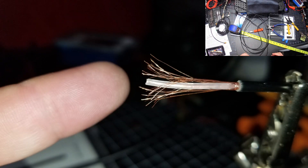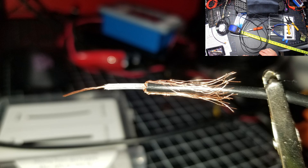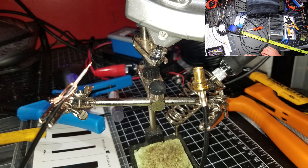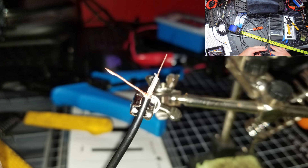Getting towards the end of the project — this is the other end of the RG-174. We're going to trim this out and separate the outer shell from the inner core so we can solder onto the gap we just made in the window line. Keep those nice and separate so we don't have any shorts. Initially attach them so you can test your SWR up and down that little gap to find your best spot, then put it in place with solder. Here we've tinned them to make each section nice and neat, then soldered it on and covered everything up with heat shrink.